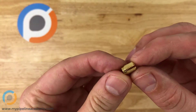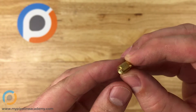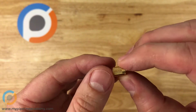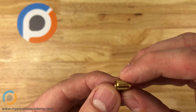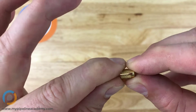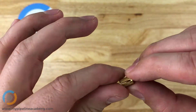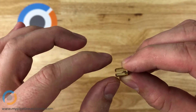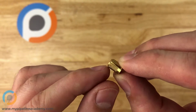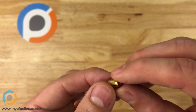Another style is this one here. This is also brass, but it's not meant to conduct any heat. This is a press-in threaded insert, and it would be used in plastic or maybe even wood. You can see this little slit right here that allows the whole part to compress a little bit when you push it into the hole. Then when you screw the fastener in, it expands those two ears again, pushing them outward towards the plastic. You can see this rough knurled surface here — once that gets pushed into the plastic hole surrounding it, it kind of locks the insert in place.